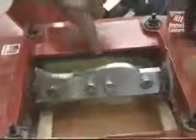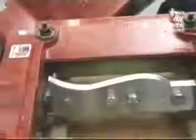Now these rollers, those yellowish colored rollers, actually move the material under the knife. Now I need a guide to make sure the stock stays straight under the knife. So what I like to do is take a piece of 1/4-inch plywood, mount a couple guide strips on each side, and that ensures me it's going to go straight through.